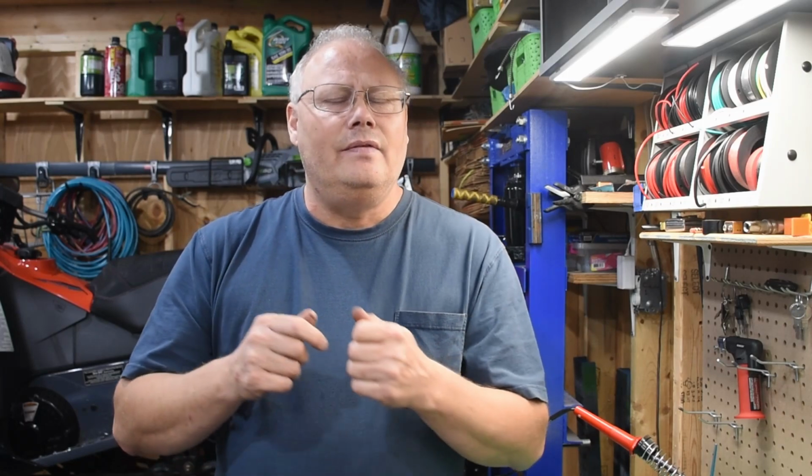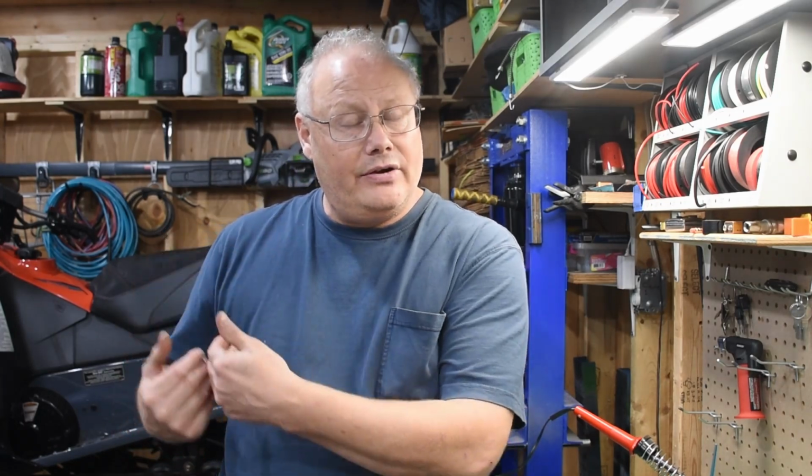So I decided that if I couldn't get it running, I wanted to understand why I could not get that running. So I called my friend up and he did come over and help me to trace the unit out. So we went through and looked at the different legs of the generator circuit, the 120 volt legs, which ultimately combined into the 240 volts. And they seemed to be pretty good.